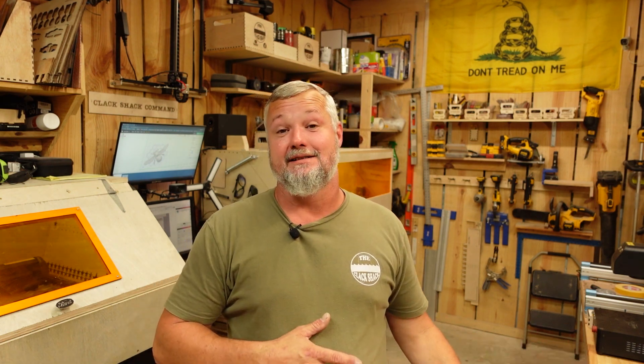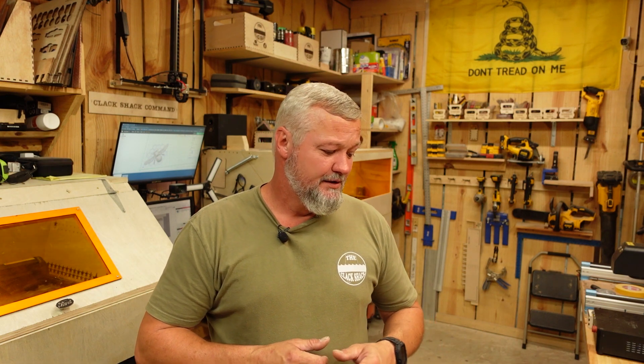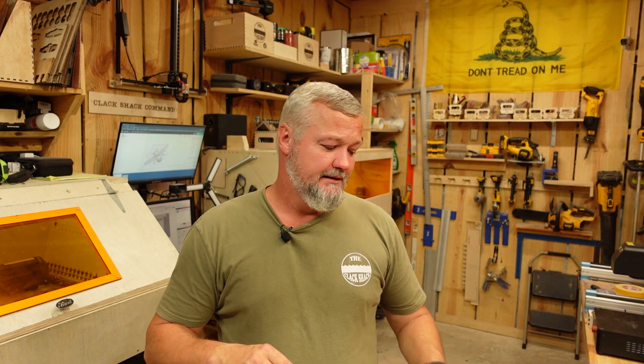I just wanted to share this project. I'm proud of this — my very first 3D with the CNC and I did not destroy it. I was a little nervous about the bit change. I used an up-cut bit for the roughing because it's removing more material and that kind of pulls the material out of the hole as it cuts through, especially with the pecan. I was afraid if the material stayed in the hole it would dull the bit faster and maybe cause burning and scorching inside there. So the bit I used for the roughing was a quarter-inch up-cut with a flat tip. That process took around six hours. Then the finishing part took I think four and a half hours, using an eighth-inch down-cut flat-tip bit for the finishing.